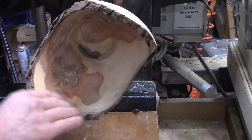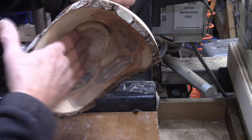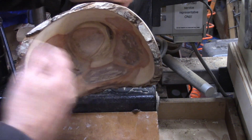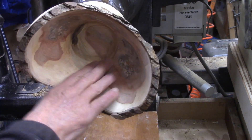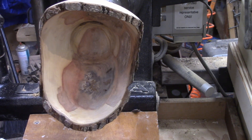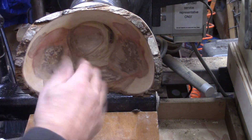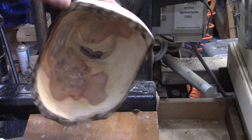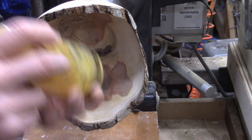So what I'm going to use is Howard's. It's a really nice finish — I don't really know exactly what it's composed of, but it almost acts like an oil finish in a way and it's got wax in it. I think it'll just be a more subtle finish on this one rather than try to use lacquer or build up shellac. That's my reasoning here — to accent the beauty marks.